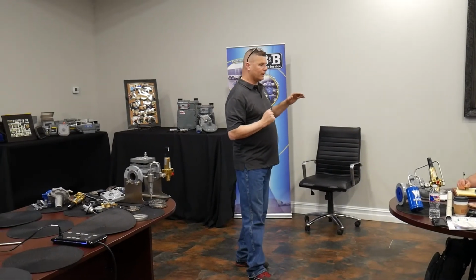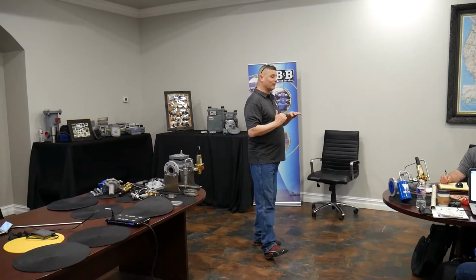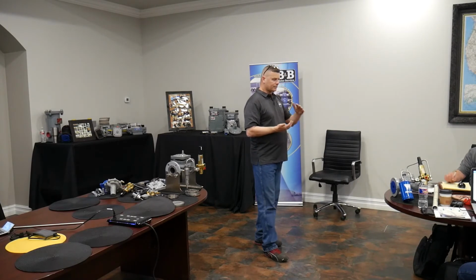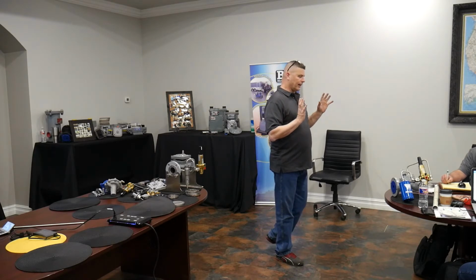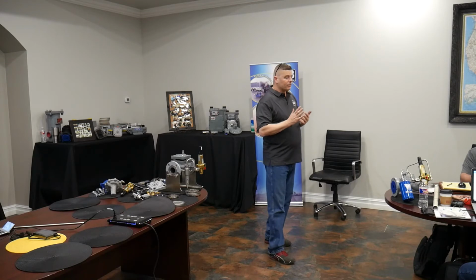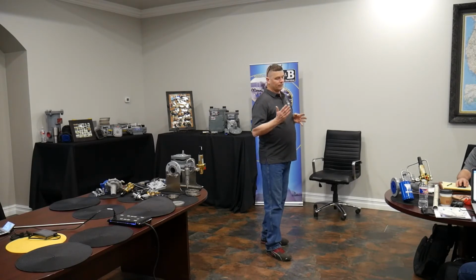So you need to go to MCFH. If they're giving you something else, MCFD, standard cubic feet per minute, whatever they give you, you need to convert it to MCFH, and then divide that by the inlet pressure, P1, okay? And we're just going for a broad look, a thumb rule check at what the CG would be required for those applications. Because if I'm making a deeper pressure cut, I'm going to get the benefit of sonic velocity.